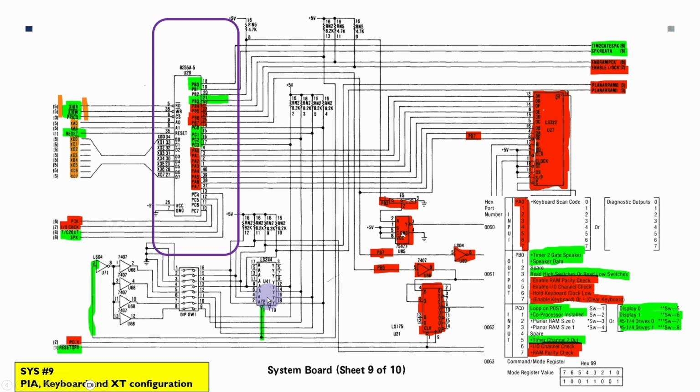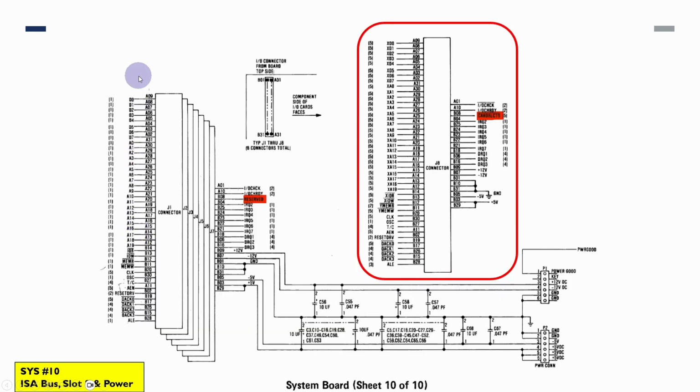Now to start with, we're just going to hard code that information into the BIOS, so I don't need it to be configurable. Then the expansion connectors, the power strip bus that we have is largely going to have most of this information. Things like the IRQs and the DMA lines will probably just wire directly into the breadboards with those, but we're certainly not going to worry about the X bus side of things.